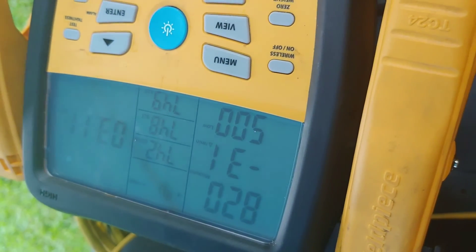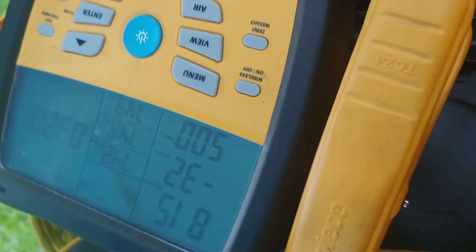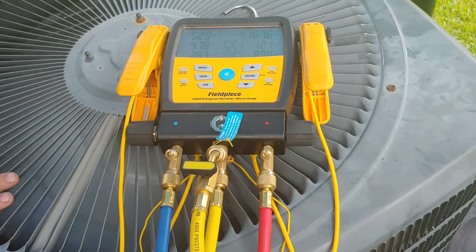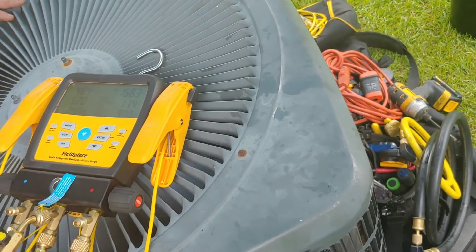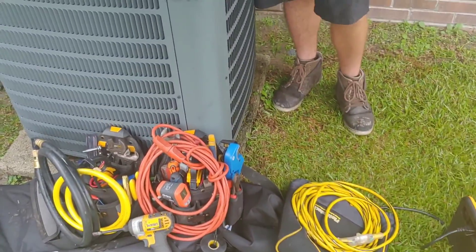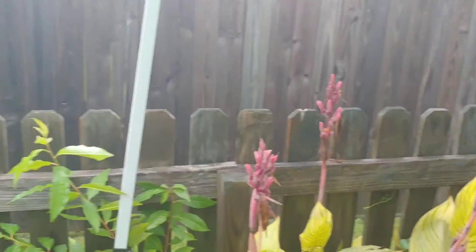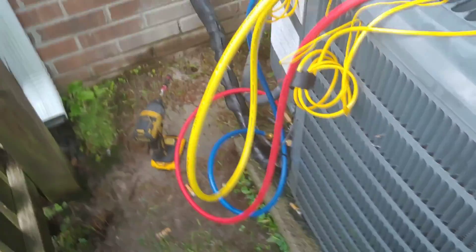I'd say we're a little low, but we'll let it level out. That's pretty much it — we've got all this equipment out here, the tent, the new coil is in there. We're going to put some refrigerant back in the system. We did a pressure check for about 20 minutes, it didn't have any leaks. It is drizzling — 100% humidity out here — and this tent is making it very warm. Alright, we'll see you guys in the next one.